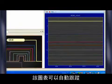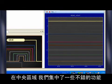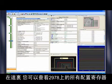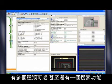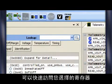The plot will automatically track any monitoring parameter you have selected in the GUI. In the center, we have the meat and potatoes of our software. Here, you have access to all the configuration registers in the LTC-2978. There are a couple different categories to choose from the tabs up top, and there is even a search function to quickly access the register of your choice.